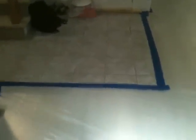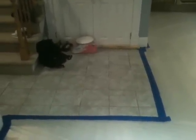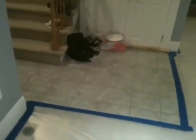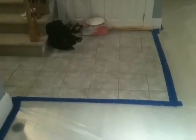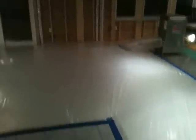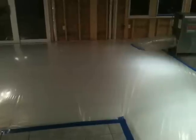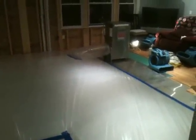We're hoping that this dries the entire floor system out here, including the tile floor, because this system even goes under the tile floor. If we pressurize this enough, the pressurized hot, dry air should go under the tile and dry out the heating system and the grooves that are under the tile as well. We also have to recreate and do this upstairs on the second floor — we have the same systems in hallways and even a bathroom. So this is a tenting situation, driving hot, dry air under a damaged radiant heat floor that we're going to dry out. Thank you very much for watching. Clay King, AAA Flood.